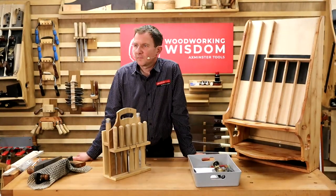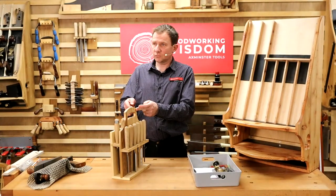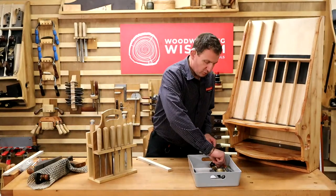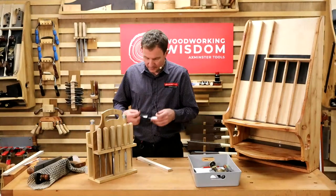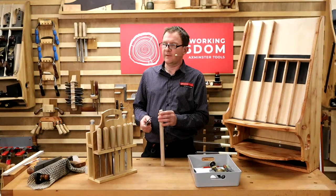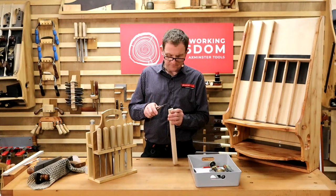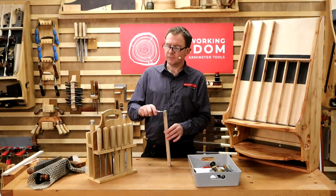Good afternoon everybody. Quick question: how thick was the material — the French cleats? We use birch ply. We're a real fan of birch ply in here. The only thing we don't like about it is it's kind of expensive, but it's incredibly strong and good thickness. This is actually 15mm. So we use 15mm ply. The strips have a 45-degree angle, so at the top I've got about 41 or 42mm. All we did was make them all the same — it didn't matter where they go. We ripped it down into rectangles to make it easier, then ripped them down in half to do the 45.